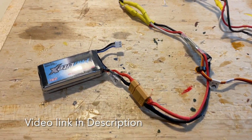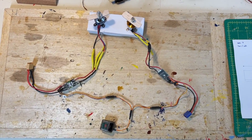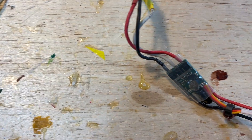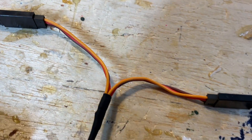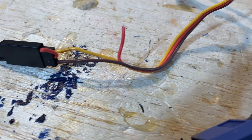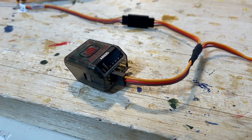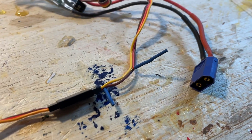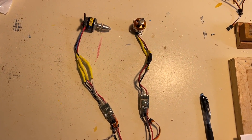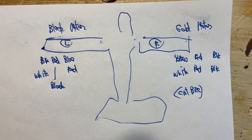This is a review of the setup of the two batteries and two electronic speed controls for the two motors — typically the easiest way to do it for a sports setup. Notice there is one receiver and two ESCs. Because of two ESCs, you've got to cut the wire of one electronic speed control for the battery eliminator circuit — that's the red wire — so you don't get conflicting signals to the two different ESCs. Here is the cut wire; it's still a hot wire, so it's important that you put some heat shrink tubing on it. If you need to use that ESC again, simply reconnect the two wires. You may have to reverse any two wires on the motor to reverse the direction. I keep a little diagram of the left-right motors and where the various wires go.